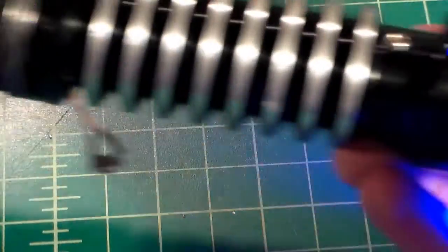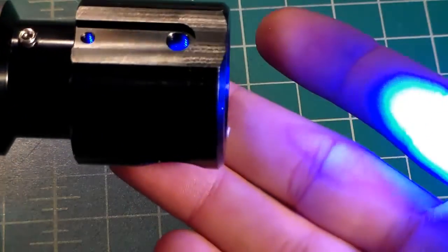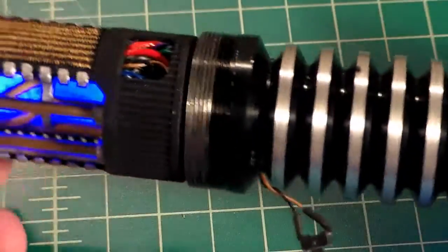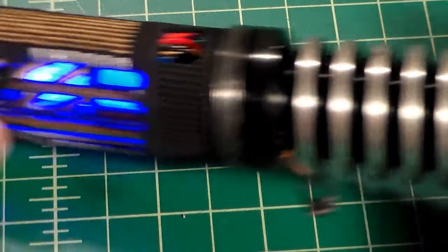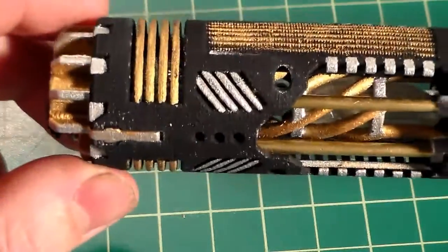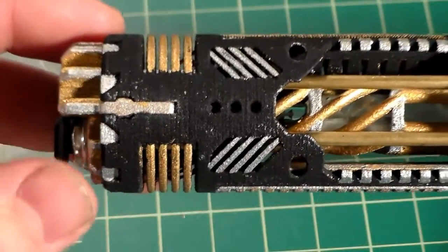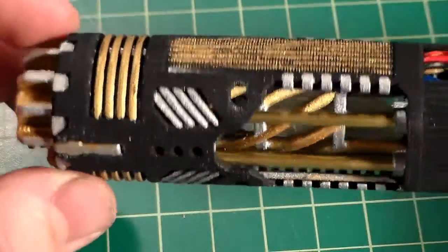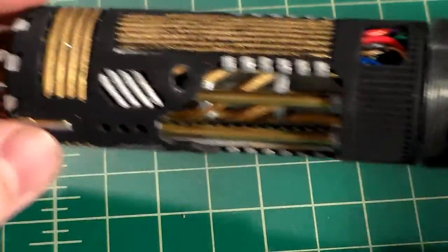Now, inserted in the chassis, it is going to be a little more delicate. A little harder to activate the flash on clash. And you'll notice that maybe we get some false swings. The false swings are most likely due to the fact that the battery is not at a full charge. You'll get that a lot in Plecter boards. Even though the battery will say, if you test the battery, I've tested them before and they say like 3.6 volts. That's still not a full charge, so you may get false swings.